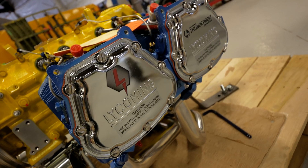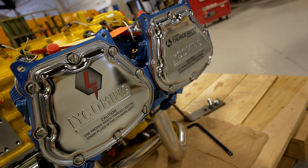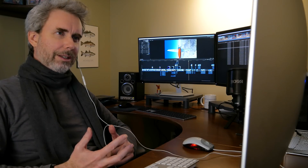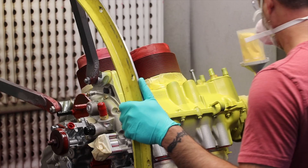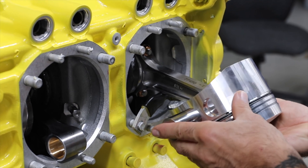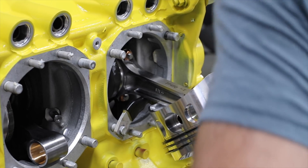You won't be as tired when you fly with this engine. It comes with the chrome rocker box covers, and you can do multiple different colors — I've done camouflage. We can do pretty much anything with our guys downstairs; they're really good builders. On the balancing, it's within half a gram. We benchmarked with other race shops — like with the cars — and found they liked that half-gram tolerance. Our builders get to pick and choose from a whole box of pistons for each engine. I've heard it many times from customers that they can feel the Thunderbolt is a lot smoother than other running engines.